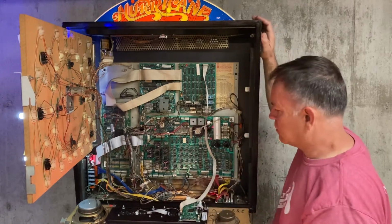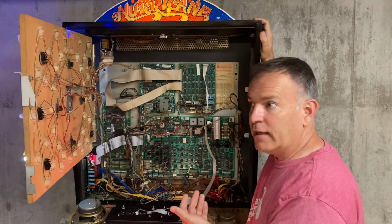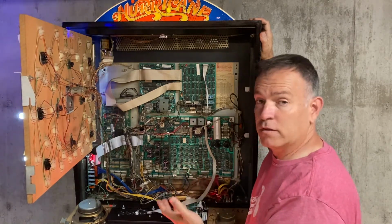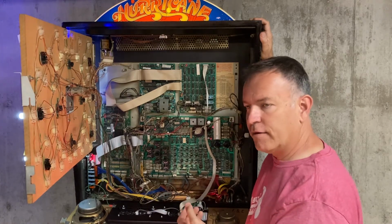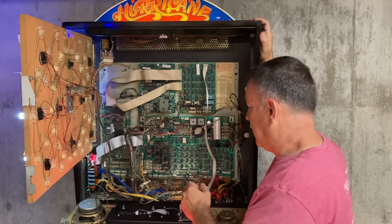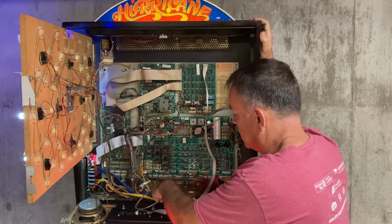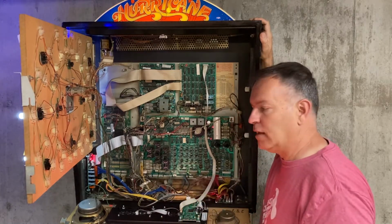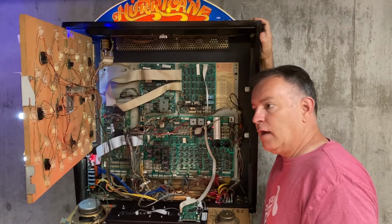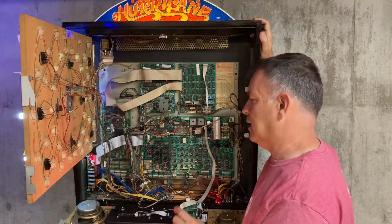There were a few connectors that were rebuilt. You know, the typical problem with a lot of the GI lights: the connectors are drawing so much current, and there's a lot of heat, and it gradually fries the plastic over time. And that's what had happened. Some of these connectors are down here, and the reason they're positioned down here is because we also added the OPC LED boards as well as the OPC GI board.